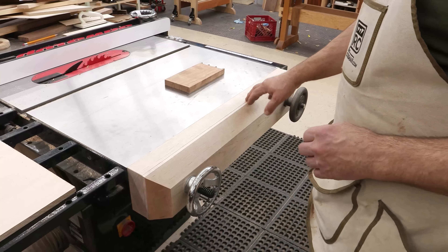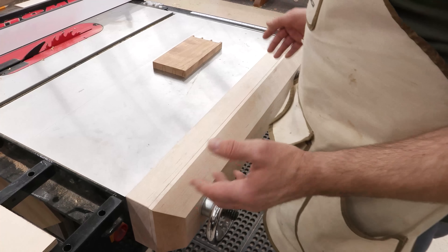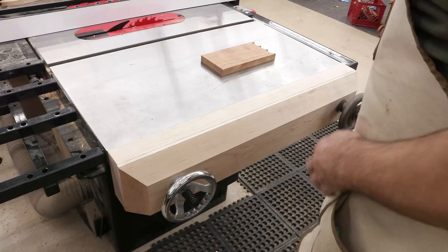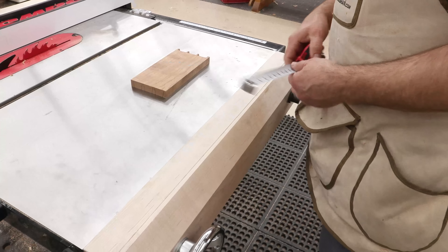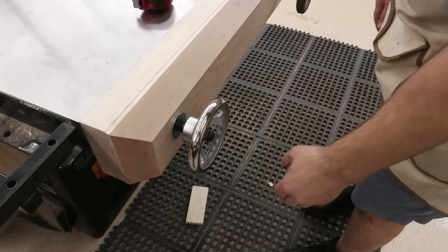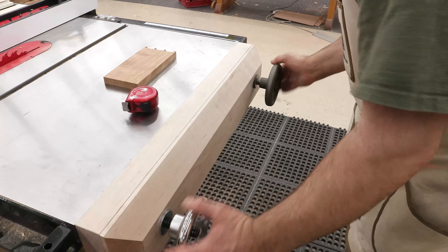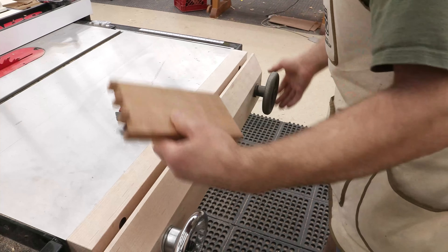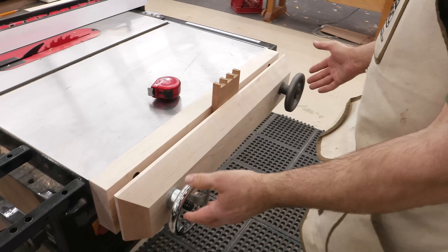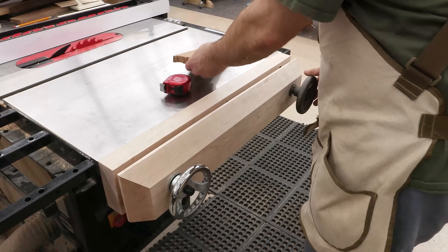Here they are in action. This is actually an idea of Jason Langell — we'll leave a link below. Great way to give yourself a vise when you don't have a proper bench — attach it to the end of your table saw. We decided to put one on one end and one on the other, and try them out. This is maple, and your capacity here is 30 inches. You spin that — that's what you get. This one, spin that — it's probably not quite as smooth, but not a huge difference. You open it up, drop your board in there, and snug it up. That holds it firmly; there's no way that thing's going to budge on you. Absolutely fantastic for holding your work vibration-free.